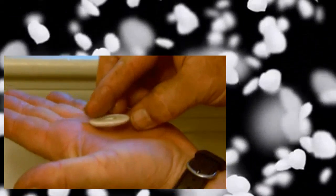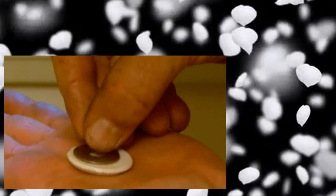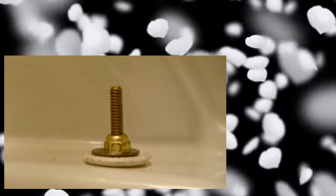And now there's a batting order for the final connections to the closet bolt. The first is a white plastic base, flat side up. It's usually marked. Then there's a washer. Then there's a nut. And finally there's a bolt cap that covers the whole bit. Okay, now we tighten it up with a socket wrench. Okay, that should do it, I think.